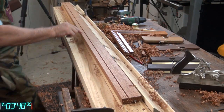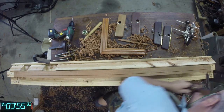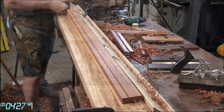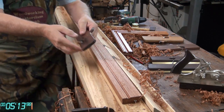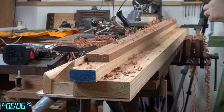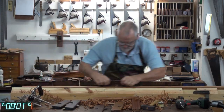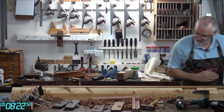As you can see, that leaves a nice deep V for me to push the round down. Now start widening it out by moving the plane from side to side. Good — that takes care of the cove.